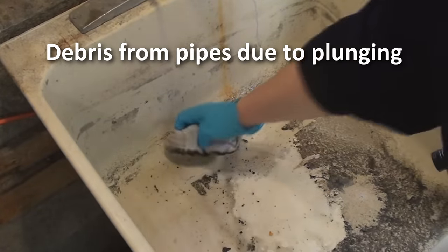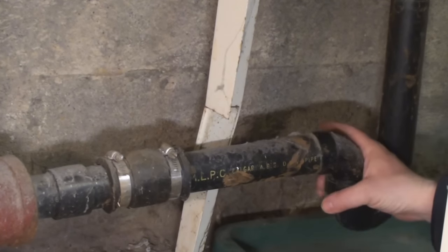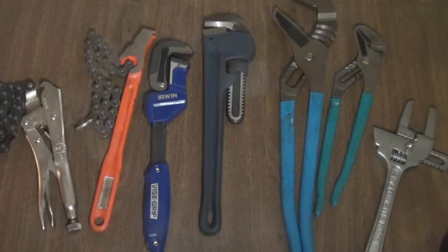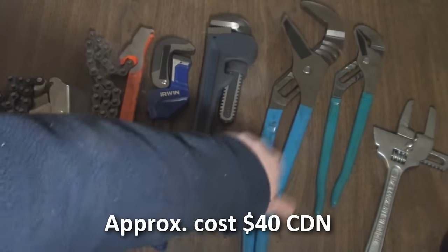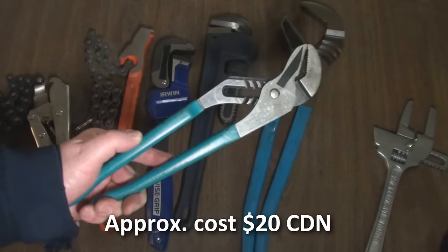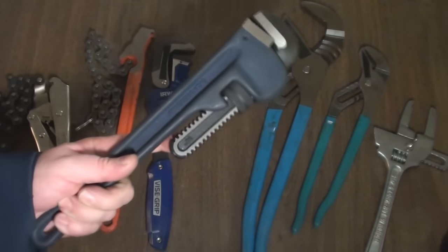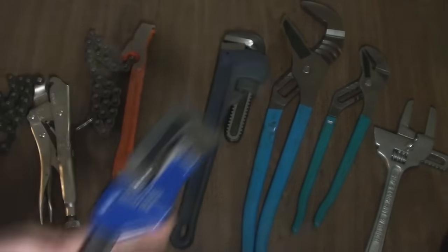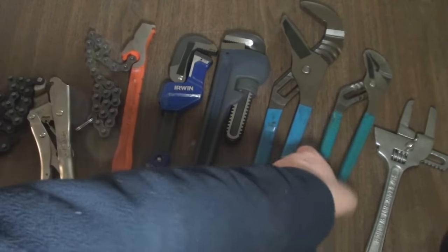I've got a lid from one of these Rubbermaid storage bins to use as a catch basin. Very often you can just undo these by hand — you don't even need a pipe wrench. Now, there are a lot of options available to you as far as what you can use to open up that elbow joint. This pair of channel locks might be kind of overkill. An ordinary pair you might find in virtually anybody's kitchen drawer is really all you need. You can use a pipe wrench, but pipe wrenches are heavy and cumbersome and might damage the plastic pipes. There are new-style pipe wrenches available that are very effective, but that's kind of an expensive wrench for the average person, so I'd still recommend medium-sized channel locks.